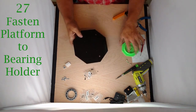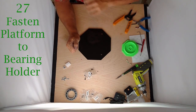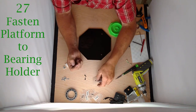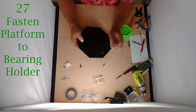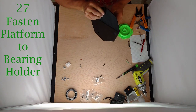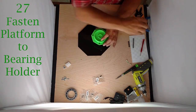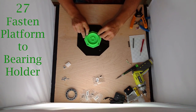The platform will have masking tape or masking paper on it, but we pulled that off in step one. We're going to look for some more M3x10s — these are going to be self-tapping holes so they'll twist pretty tight. They might just drop in from one side and self-tap from the other, so you want to find which side is which. Stick the four bolts in the printed part, find the Allen wrench, find their homes and settle them in. You may have to apply a little bit of pressure to start because they're self-tapping. You can feel it'll start to tighten up — that's pretty firm.